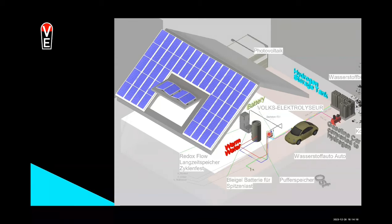The electrolyzer will then split the water and produce hydrogen on the primary stage. After a while, it will also emit heat, shown here in red. The excess heat goes into the buffer tank. The PEM electrolyzer works at 70 degrees, which is a very good temperature to use for potable water as well as for heating purposes.